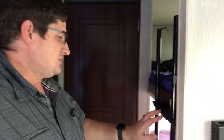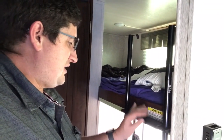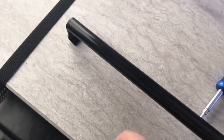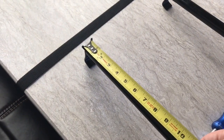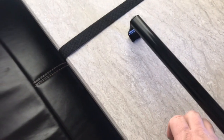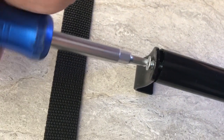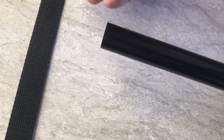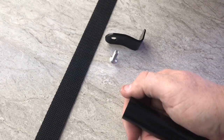The reason for vertical mounting is because of the location of the ladder — so the bathroom door can still open all the way and the kids can still access it. So the first order of business is to figure out where I'm going to put the actual brackets and how much of the legs I'm going to have to saw off. I've already done the measurements, and it's just a matter of removing the brackets with a Phillips screwdriver, switching from the hook assembly to the mounting bracket assembly, then measuring twice and cutting once.